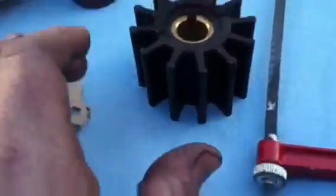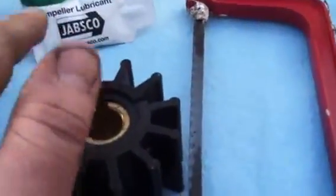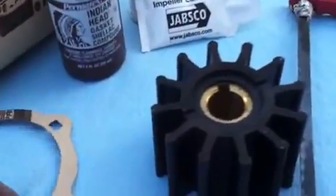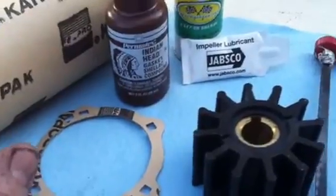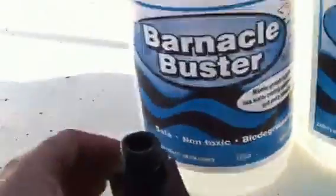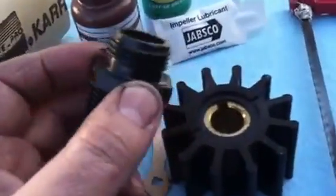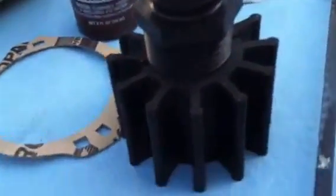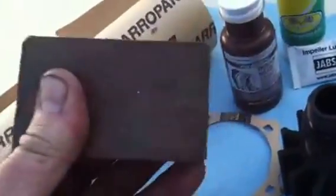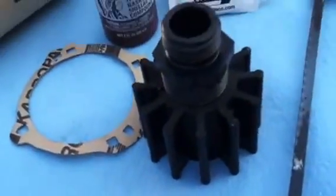When you finish the job, you've got your new impeller and your lubricant. Put the lubricant in first, get it well lubricated, then set your gasket in. I use Indian Head shellac with all my gaskets — I've been doing it since the 70s, works great. When you set the impeller in, mine is keyed, so make sure you line up the keyway. I use this little fitting made of tough ABS plastic that fits really well on there. Get the keyway lined up after you get the fins going the right direction — that's the other important thing.